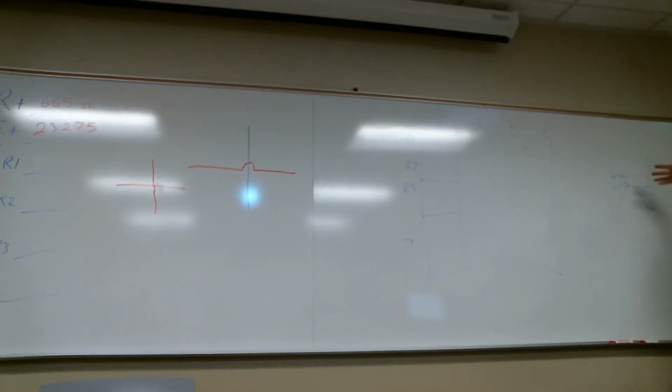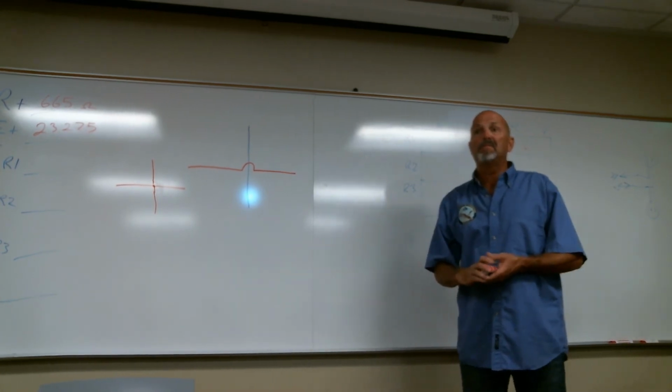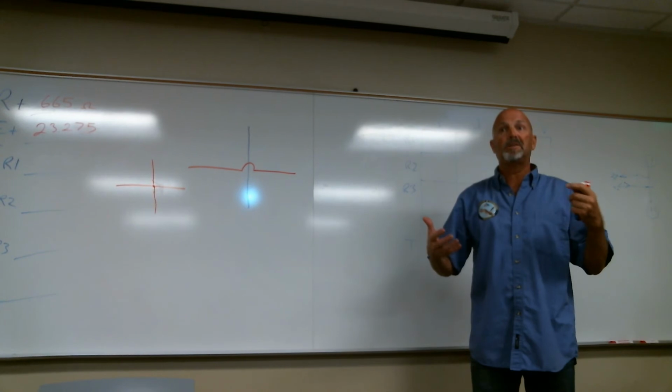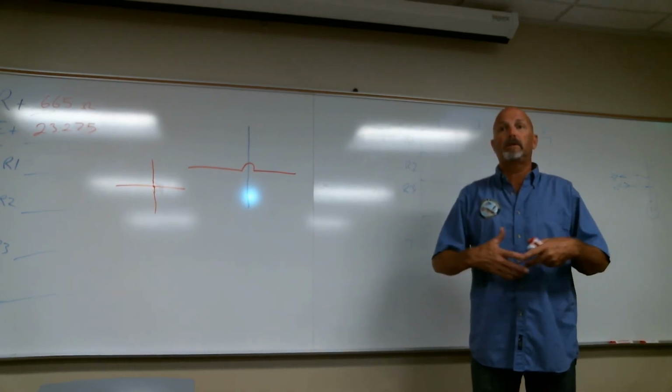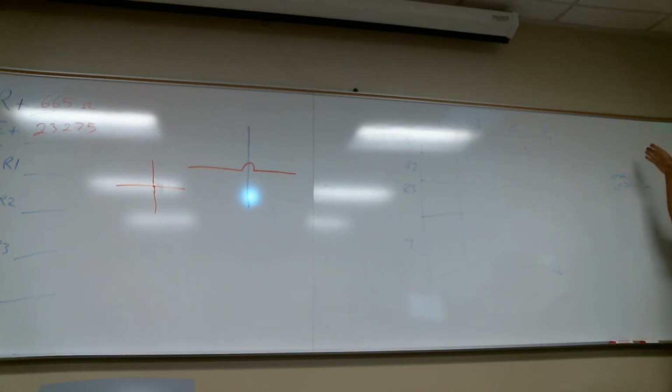AC, you can't daisy chain, you can't string a house in, well, I guess you can. But remember you were asking why they do houses parallel. Remember how much trouble we've had with Christmas lights. Yeah, you take one out, that's series. If you wire a house in series and something fails, you've lost everything. Not only that, but it wouldn't work unless you had something plugged into it.